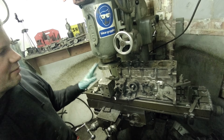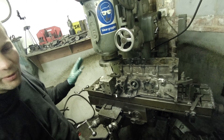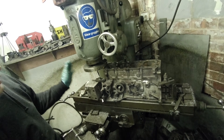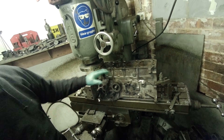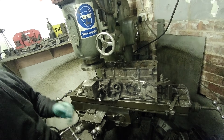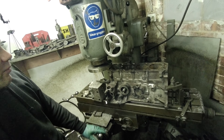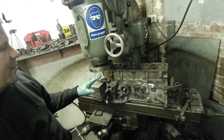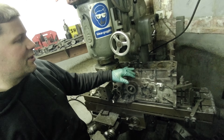We're going to run across it real slow — like 80 RPM — just clock along all the way. We'll put it on the camera, probably time-lapse it, just tickle away. Hopefully it's not going to be too hard where it's been welded — the cutter will just come through it. We'll probably start with like five thou cuts and just tickle it. It's got a new tip in it so it should just cut through. Five thousandths of an inch, yeah.